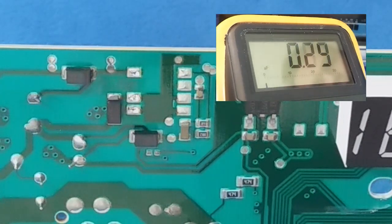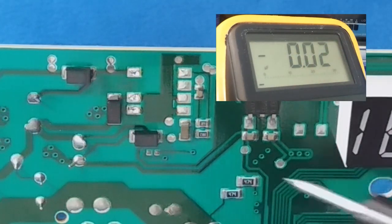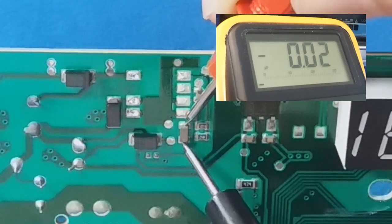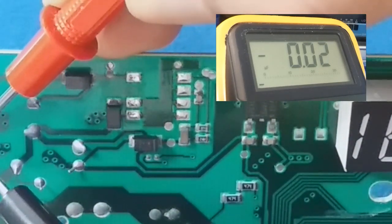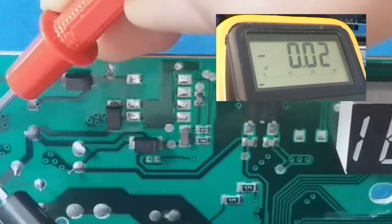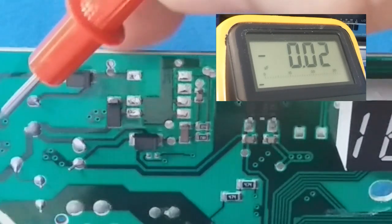Guys, we must remove capacitors to test them. But sometimes when we take one chip off or one component, maybe our capacitor gets free connection. So that's what I'm trying to do here. I'm expecting about 0.1 microfarad capacitor. That's not the right measurement for it. I went to the big one, same situation. I must remove my components and test them one by one.